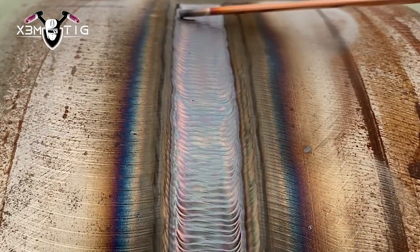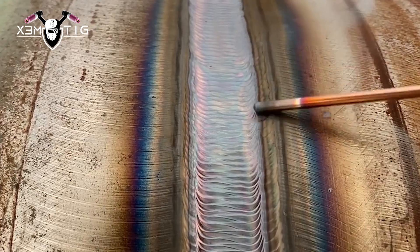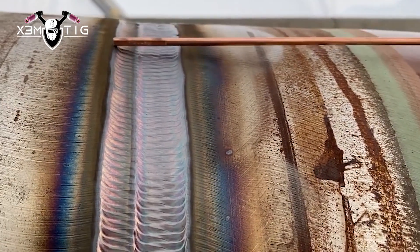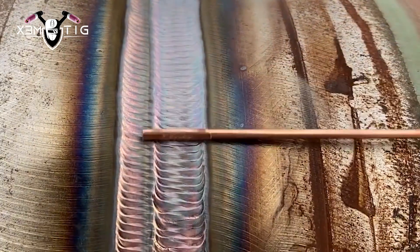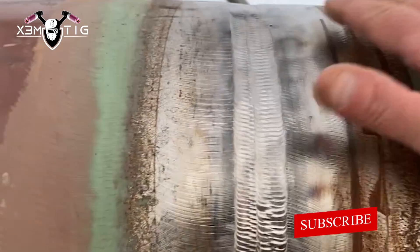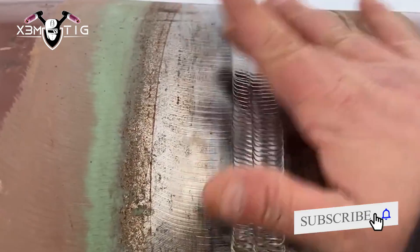Put the fill in the middle — still probably a couple passes left. As said, put the rod on top and that gap underneath tells you how much to fill. Do a couple more passes until it's nicely filled to flush. For any uneven spots, go back and do an extra pass here and there on the bottom or sides. Let it cool down a little bit — it works better when slightly cooled off.